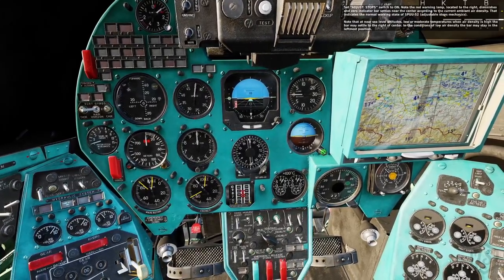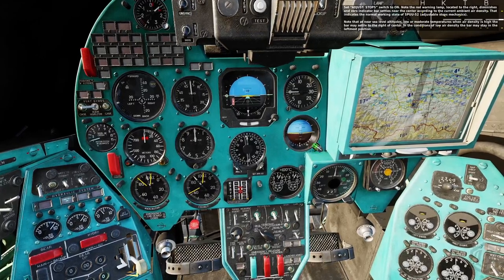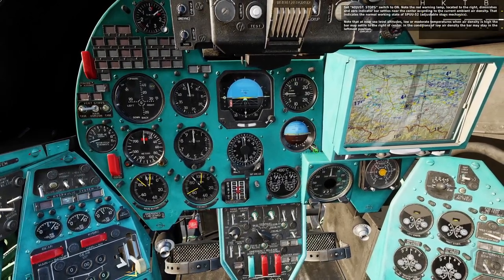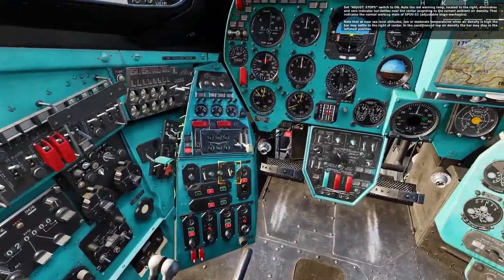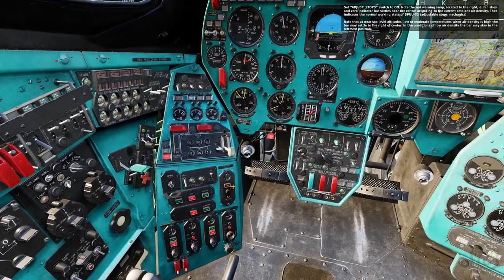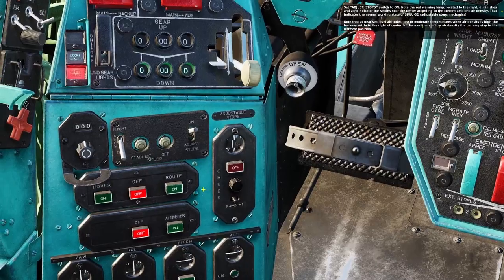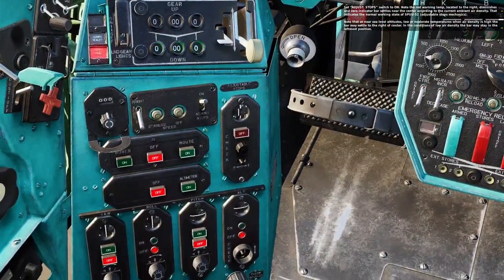Set adjust step switch to on. Now the red warning lamp located to the right diminishes and zero indicator bar settles near the center according to the current ambient air density. That indicates the normal working state of SPUU-52. Note that at near sea level altitudes, low or moderate temperatures, when air density is high, the bar may settle to the right of center. In the conditions of low air density, the bar may stay in the leftmost position.